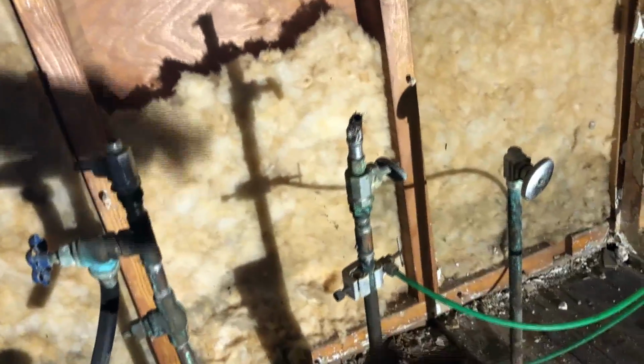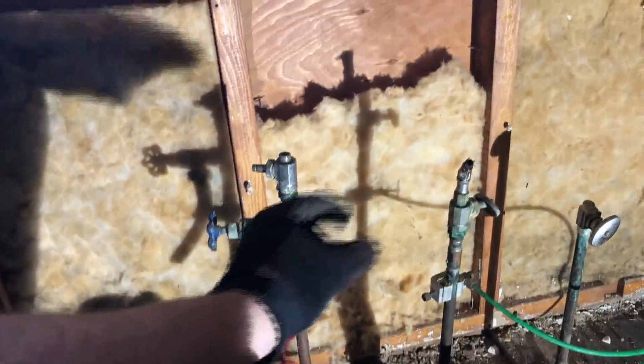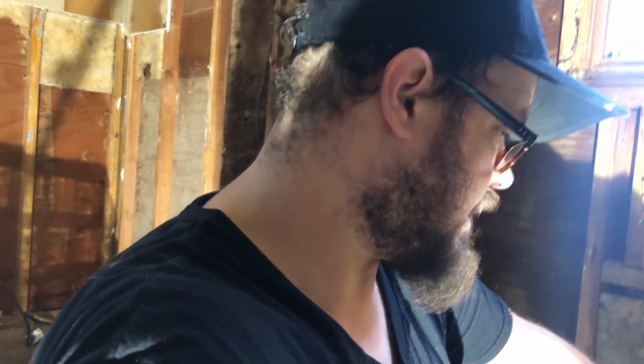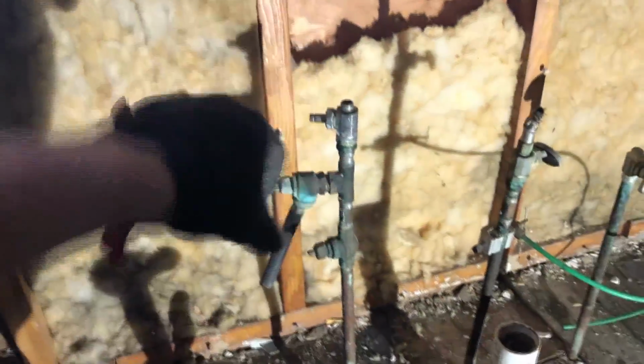and that way when we put our flooring in, we put our tile in, we put our cabinets in, all we'll have is the stems with caps on them. So when we make our holes in our cabinets and our tile and stuff like that, you only have to make a 1/2 inch, 3/4 hole, as opposed to this thing sticking out here about 3 inches. And it just takes a lot more work to cut around that stuff. So what I like to do is cut everything off, just put caps on it. That way, when it comes time to put the additional material in, you only have to make small holes. And then once everything's in, we'll come back and we'll put all our valves on it. So that's what I'm going to do right now.